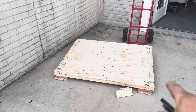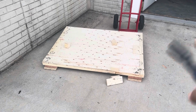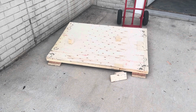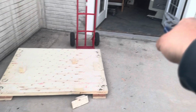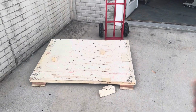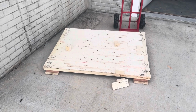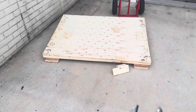Word of note is that, so your feet are lowered down onto the pad here, or on the pallet, you can see the 4 spots there. Best thing to do, take the screws out and then raise it up a little bit more. Because you have these little spacer pallets that are sitting underneath the laser itself right there, like as an extra brace. So if you raise it up a little bit, you can knock those out of there with a little hammer, and then it'll be freed up. And then raise those feet back up into there, and you can work it off.